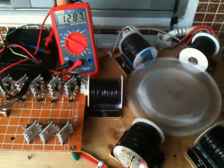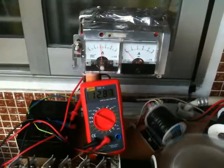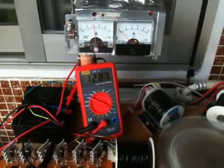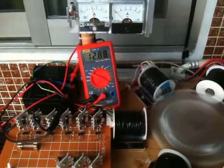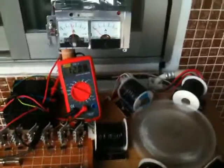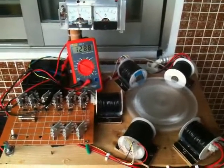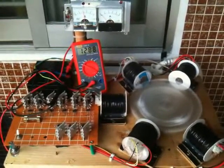But it's actually showing me that the extra 600 to 700 milliamps that I draw with the circuit and the trolley wheel is just because of the weight and those bearings. That's exactly what I needed and what I had thought was going to happen. So when I connect it to the DC generator, I pretty much know what to expect.